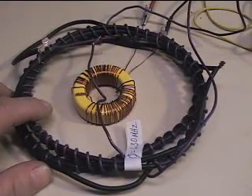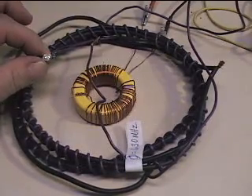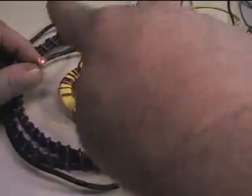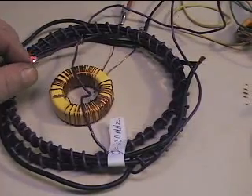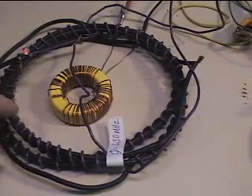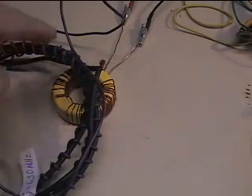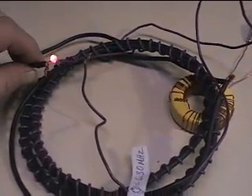Actually, I didn't have it at 6.3 MHz — I had it at 6.3 KHz. So at 6.3 MHz we can see this LED is lighting up. Just to show you, it has to do with this center wire here. One of the wires of this whole winding is going above the toroid, and because of that I'm getting light. Otherwise it's very difficult to find the right place. It will also work if I just put it on the side here — any of these wires going through the center, I'm getting nice lighting.